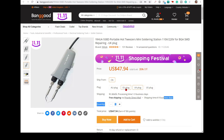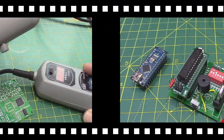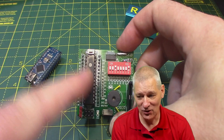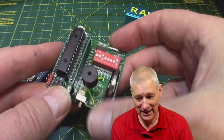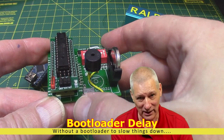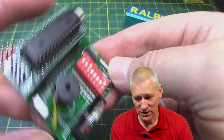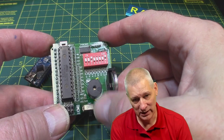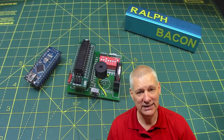Don't forget to select the correct plug for your region so you get the correct voltage for your country. Now I've swapped over to my DIP version of the bare naked Arduino. Look what happens regarding that bootloader delay - because there's no bootloader on this chip, as soon as I switch on, immediately, see - now it's running and beeping away because the tilt switch is active. The beep on here is also many times louder than it was, courtesy of the new ToneAC library by Tim Eckel.